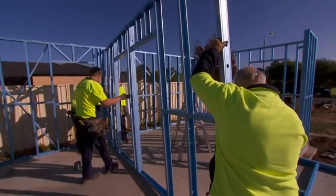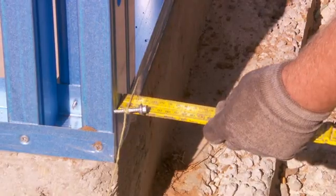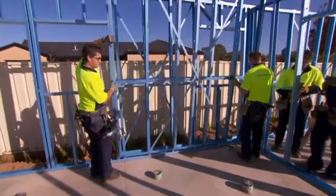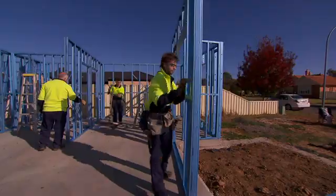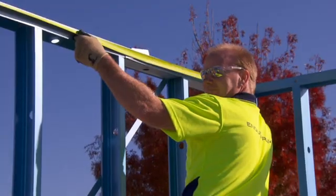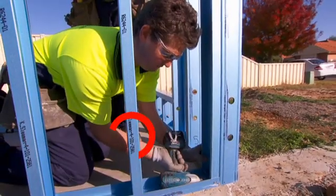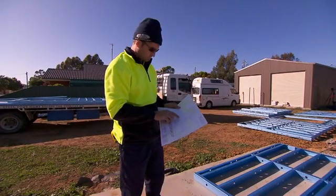Make sure you set the interior walls inside the building before completing the exterior walls. Run a string line between the two corners and align the wall to the string line. When all walls are standing, complete the frame to frame connections in accordance with the details in the construction manual. Move the frames to align with the marked wall position, check room sizes and ensure rooms are square. It helps that the branding is always on the outside, which is the same way the arrows point on the drawing.